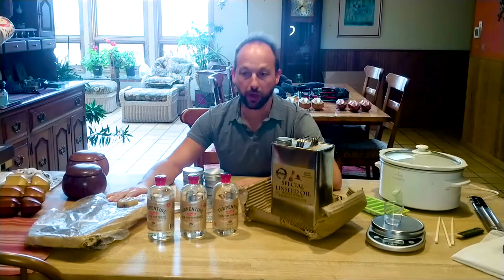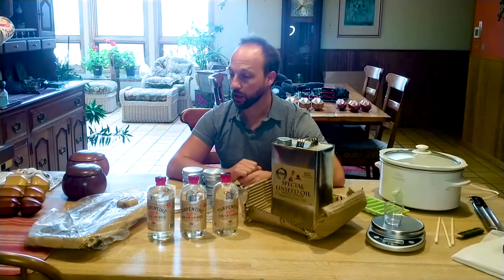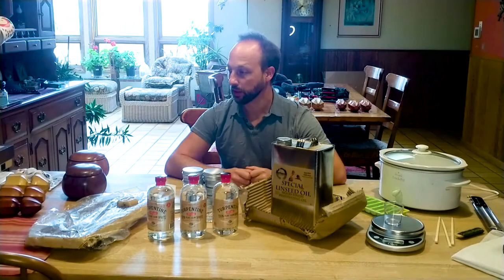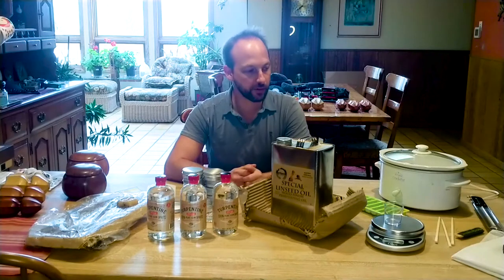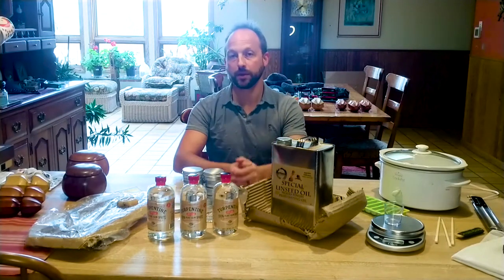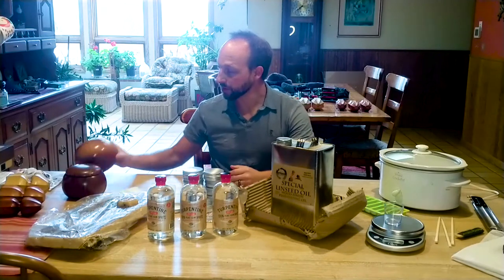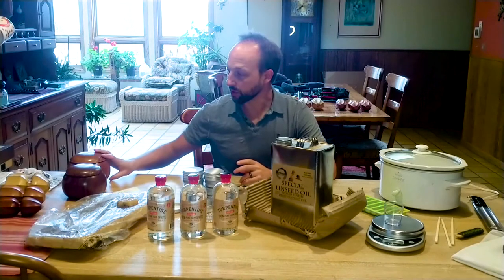You can also use things like paraffin wax. Certain wax pastes will mix in 1 or 2% of carnauba wax, which is a much harder wax, so it gives you a nice hardness. If you're using it on a cutting board, I probably wouldn't bother because you're using a steel knife or some other kind of knife, and they're going to be way too much for the wax. So it doesn't really matter what kind of wax you put on a cutting board. You're going to need to refinish it periodically. For bowls, I could see doing a carnauba wax to have a slightly harder protective layer.